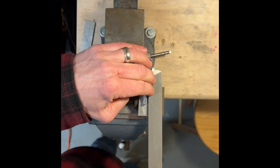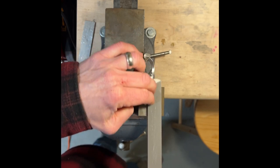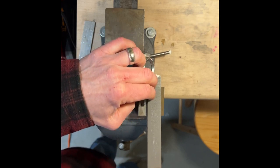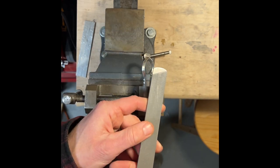I think I was using the double cut side of the file for a little bit there, but I didn't intend to. I've taken as much material off as I want. Now what I'm wanting to do is kind of finish it, where I'm taking the roughness out of the surface. So this is the sharpening edge